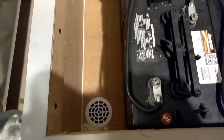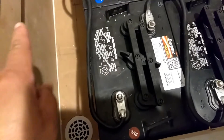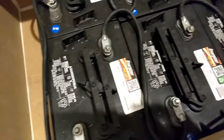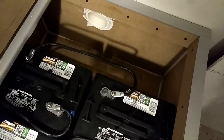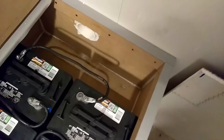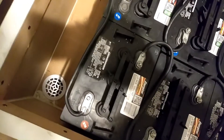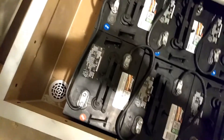Over here, right there, you have the intake. That's where the air is coming into the box. It's coming into the box there, coming up and traveling over the top of the batteries all the way down to that end right there, and that's sucking the fumes — battery fumes — out and taking it outdoors. It's not taking the fumes back up under the house. It's only sucking right there from up under the house, so it's pulling that cool air from up under the house up into the air box.